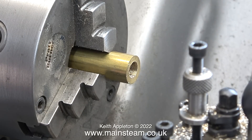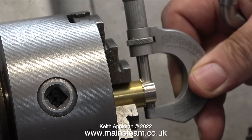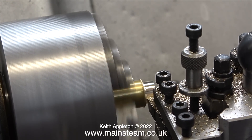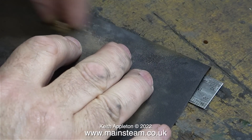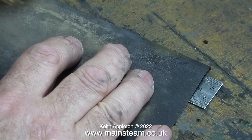Before anybody writes in — the lathe is 100% accurate, or as accurate as I need it to be. This is my micrometer set to half an inch. I need to turn down this piece of brass to half an inch in diameter so I can thread it to fit into the existing thread on the engine, which is half an inch by 26 threads per inch. I threaded it using one of my handheld die holders, making sure it was threading accurately by following it all the way down with the tailstock chuck — this ensures the die is always cutting square to the work. Once I parted off this very simple component I cleaned it up on a piece of wet-and-dry sandpaper wrapped around my steel rule on the bench.